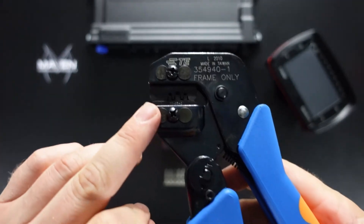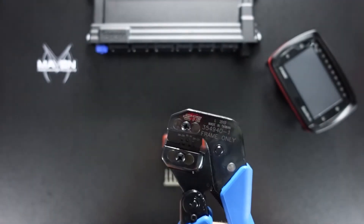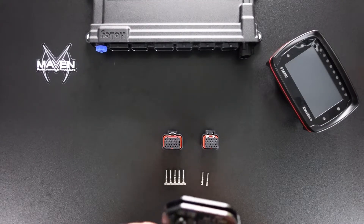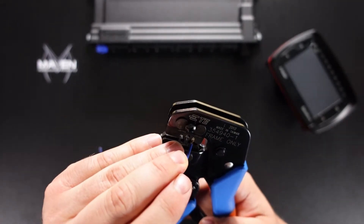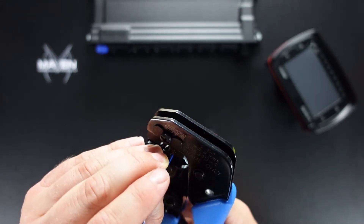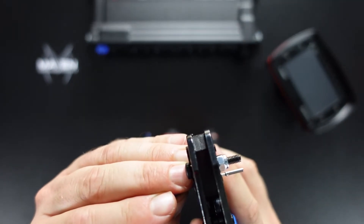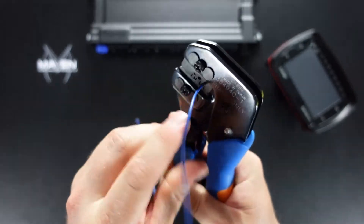This is actually the W side and this is the round side. So we're going to go ahead and find what it says on here. We're crimping a 20 gauge wire, so we'll get this situated. Once it's in place, sometimes those little ears can spring out a little bit, so giving them a little squeeze with needle nose pliers before you put them into the crimper can help. Just put it all the way in, make sure it's in where it needs to be, and then make the connection.